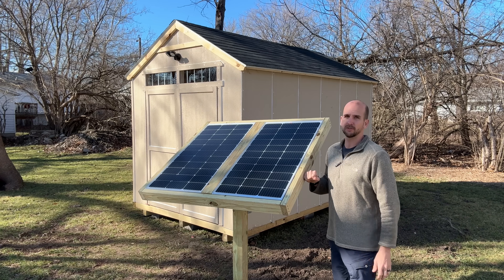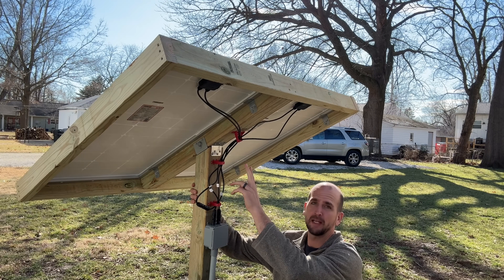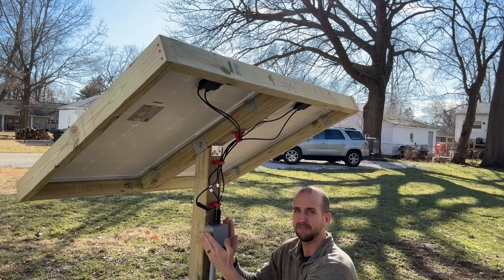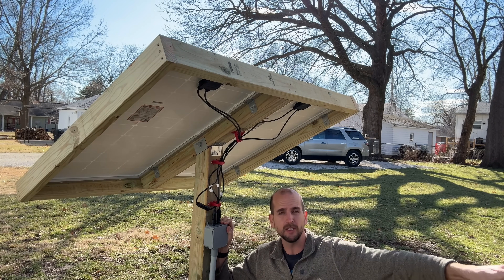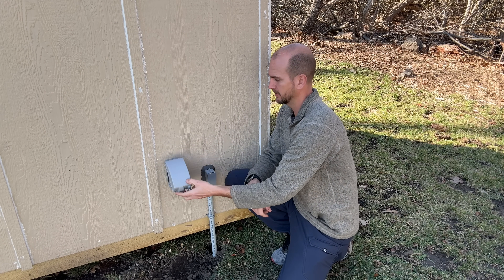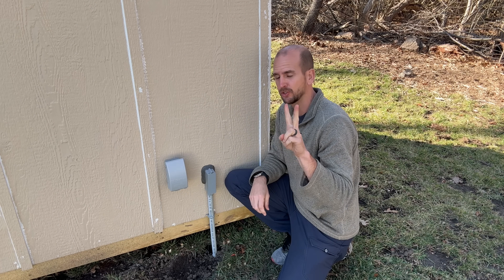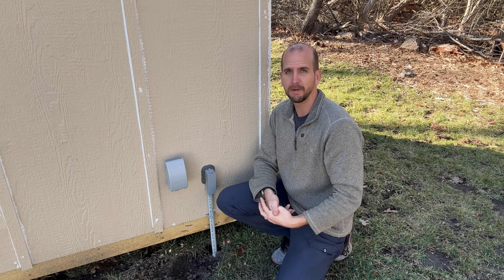My angle is around 30 degrees, so that's what I used for this ground mount with the two 100-watt panels. I wired those two panels in series, which adds up the voltages while keeping the current the same. I brought those through MC4 connectors into a custom-built PVC junction box, then ran three-quarter-inch PVC through the ground 20 feet over to the edge of the shed. At the corner of the shed, right next to the GFCI outlet, I brought in an LB fitting to give me easy access to pull my two 10-gauge THHN conductors inside the shed.